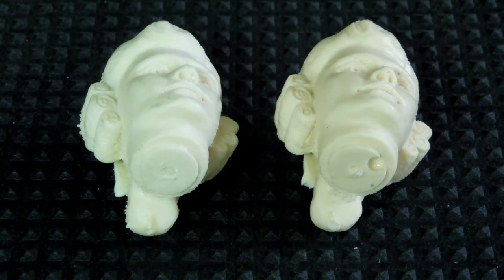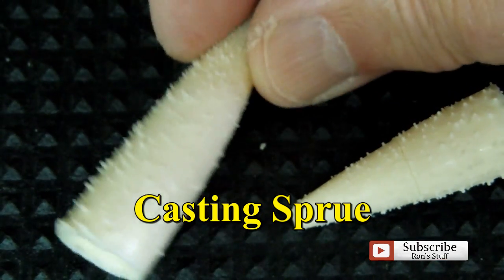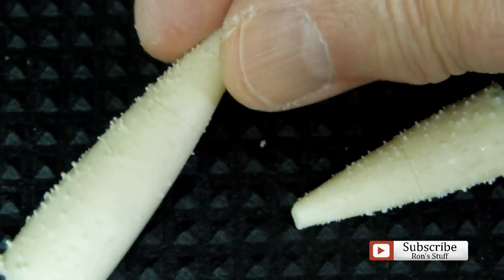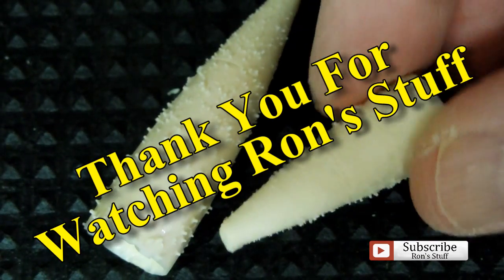So it's quite apparent I need to remake the molds, degas the silicone, and pressure cast the mold, then pressure cast the resin to get a good quality casting. In fact, the original molds have already been thrown away. And while it's difficult to show all the spikes sticking out on the figures itself, it's very obvious in the casting sprues — and these were off of the body when I did a pressure cast.